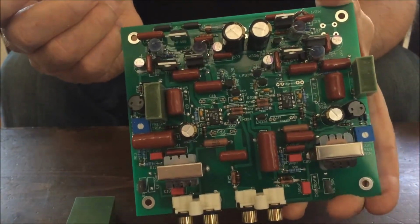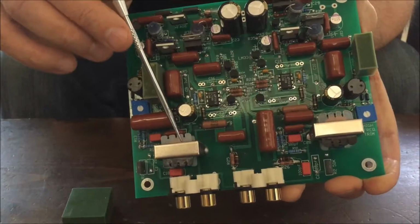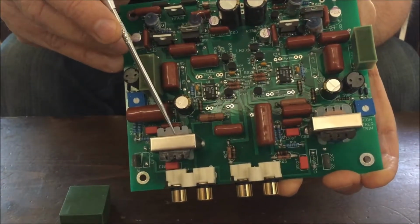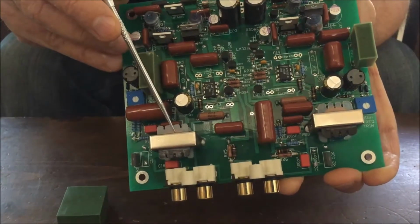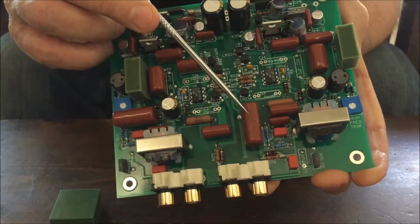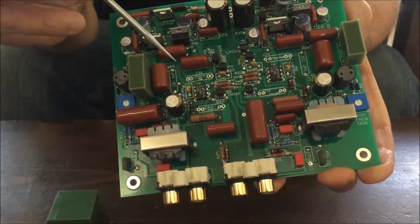They are correcting the bass for the other very unique part of the LCR Mark III, which is our inductors, which are here and here. These inductors, we have to buy a lot of them in big lots and measure them so we can match them to do stereo pairs. They take a while to match, and you have to leave them on the meter for a while until the inductance settles to its true value. And the other aspect of these inductors that helps them sound very good are polypropylene capacitors here and here. And that is your main low frequency pole for the RIAA filtering that creates a phono preamp.